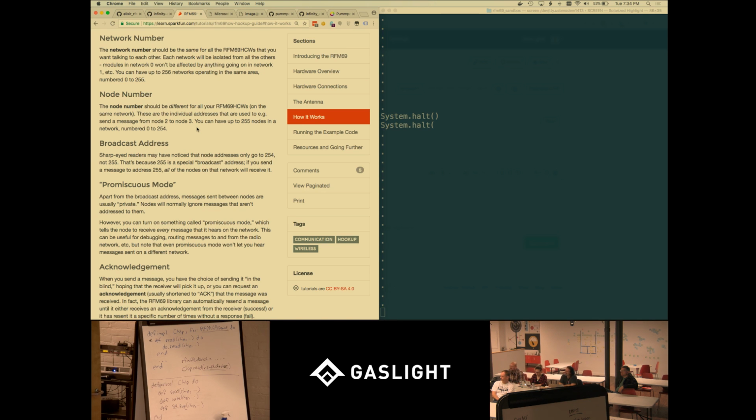When they come out with the boards, one of the boards they're developing in particular has this RFM chip. It has battery charging circuitry, a battery controller for a LiPo battery. It has a real-time clock and the ability to be scheduled to turn the Raspberry Pi back on. So if you're building a Nerves application that has a duty cycle of 30 seconds out of every 5 minutes, you could have it boot up, go right into the Nerves application, do whatever computing or communication over that radio chip you want, and then tell the real-time clock chip, wake me up in 4.5 more minutes, and then call system.halt and shut down completely. The battery connection to that real-time clock will stay active even though the Raspberry Pi is completely disconnected from power, and it'll turn it back on.